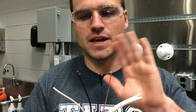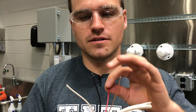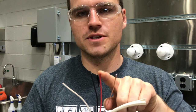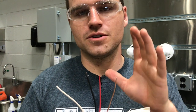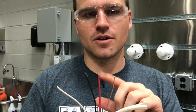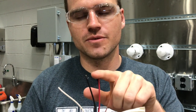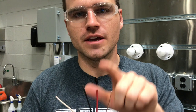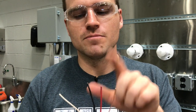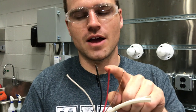That's the basics of 120 volts. Typically you're only going to be using those three wires for an outlet circuit or something like that. The red wire comes in anytime you need to be switching between something — like a hallway switch where there's a light switch at either end of a hallway. They add the red wire so you can run the power through it. I'm not going to get into what the red one does too much because you're actually going to build a circuit and see why you need it.